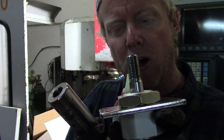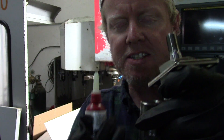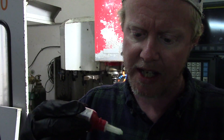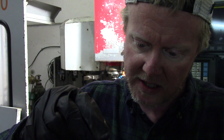I'm not going to use any of the old parts. Step one — I've got the bolt they provided taken off; I will need that. This basically has two set screws per side, four total. I'm going to put a little bit of Loctite 680, which is basically a retaining compound, to keep any vibration from loosening this up.